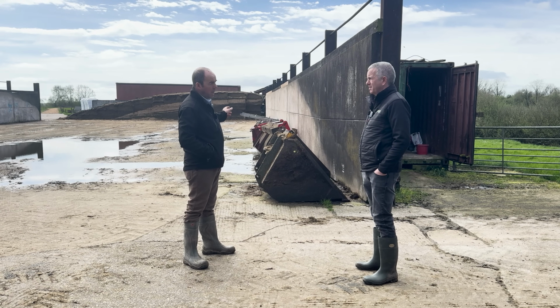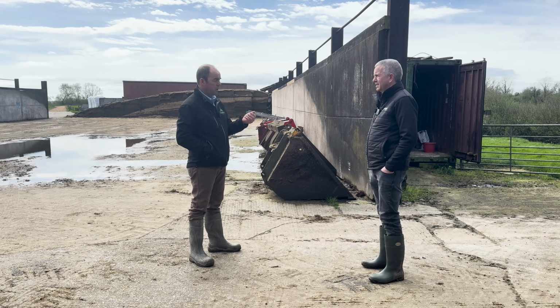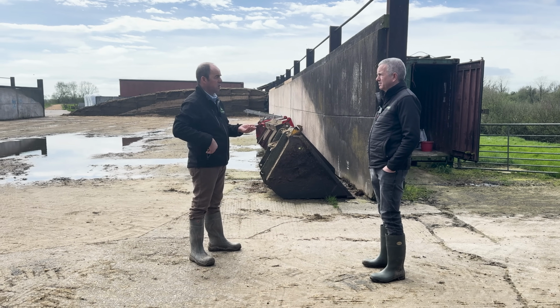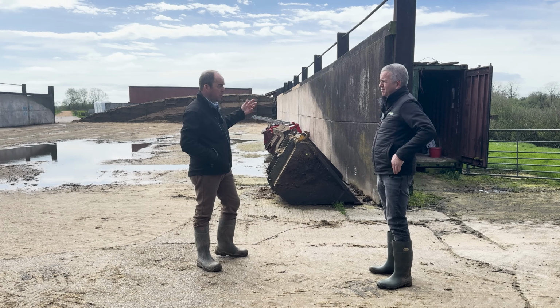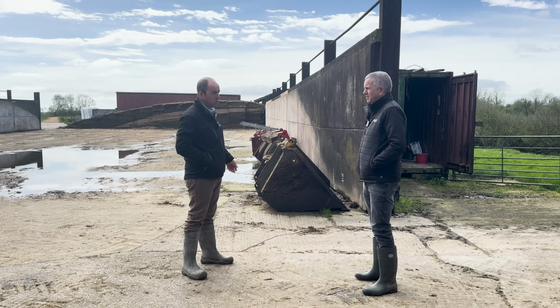Basically the silage effluent will eat into the fresh concrete. It will dissolve. It'll fizz, it's like acid dissolving into the surface of it. And you are going to spoil your very expensive concrete floor if you go on it too soon.